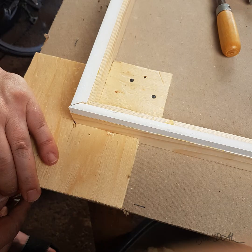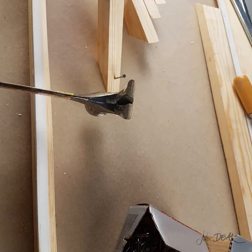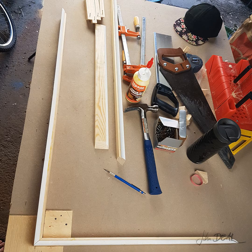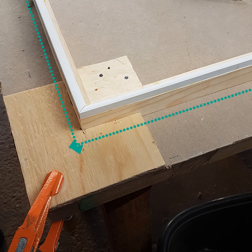Here's a quick idea of how it will work. Before we start putting together the outer frame, we'll sink a couple of nails into the brackets just far enough to have the points peeking through the other side. Here's all of our bits and pieces laid out. Let's put away everything but our hammer, nails, glue, clamps and of course the wood for our frame. With the smaller inner square of the jig fastened to the work table, place one 2 foot length and one 3 foot length into the jig butting up their ends to make a 90 degree corner.